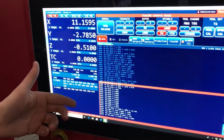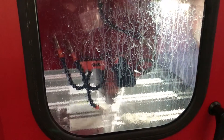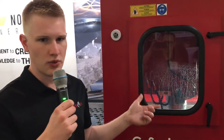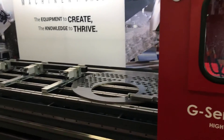Let's take another look at the control. Here we've got the indefinite read-ahead or look-ahead capabilities, meaning the machine is intuitive enough to know how many lines it should look ahead to execute the tool path properly. For a simple linear mill we'd only look ahead a few lines, but for this really dynamic tool path we're looking ahead probably several hundred lines. With the help of Mastercam and our machine, it uses what's called geometric intelligence to generate very dynamic tool paths. The machine knows exactly how fast it should accelerate or decelerate into a corner or around a radius.